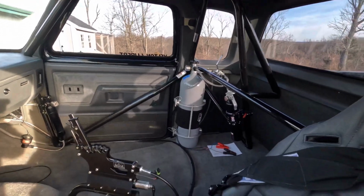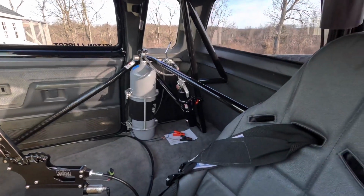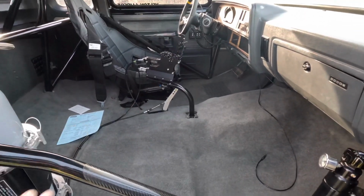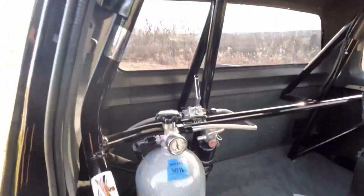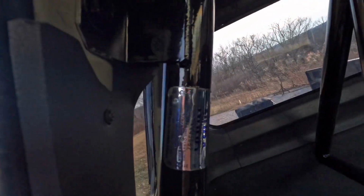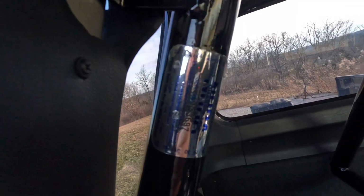But other than that, that's pretty much all that they look for on the tubes. The tube thicknesses and the angles are what I just mentioned there. So once they deem that your chassis is safe and it is good, the roll cage I should say, then they'll come over here to the passenger side of the main hoop, and they will issue you an NHRA seal of approval. And they will date stamp this, and they will stamp how fast you're able to go.